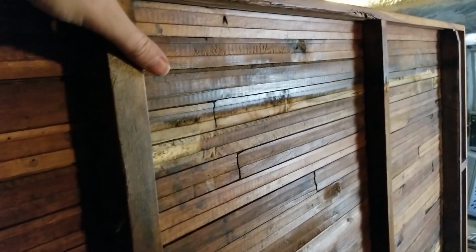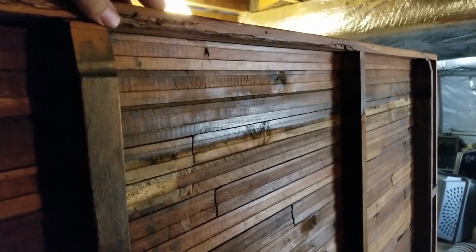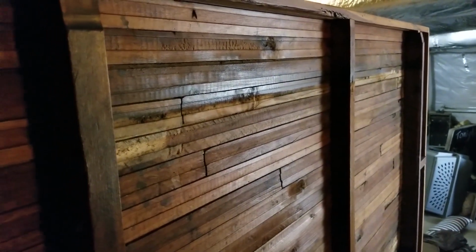And then they've got these brads that nail this piece of quarter round into the edges in random places. It doesn't even seem to be evenly spaced. And every once in a while you've got these brads that correspond with this support. So I think that if I pry up these supports and pry out those nails, really it's just the frame that's holding it in. So I'm going to start with taking apart the frame on the outside edge first, and then pry these guys up.